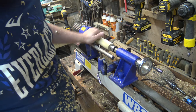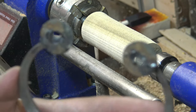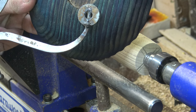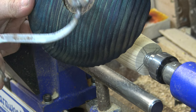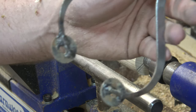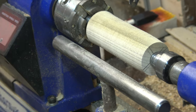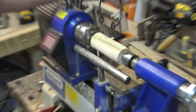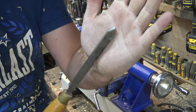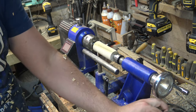Lovely greens in that tulipwood. We're going to use outside calipers — I've welded these onto washers, a tip I picked up from Mike Haselden. I'm going to set the outside diameter and come in from behind with these calipers — the washers give you a little bit more of a smoother entry. We're going to use these along with a parting tool to reduce this down to the diameter we need.